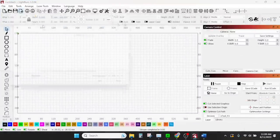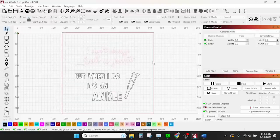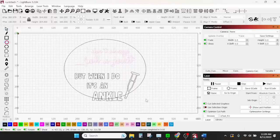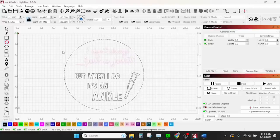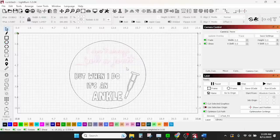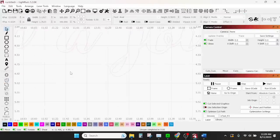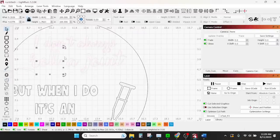Over in Lightburn, we're going to import our image. What I do need is a 10-inch circle, so I'm going to draw a circle while holding shift and make it exactly 10 full inches. Here's where it gets easier in Lightburn: all these are different little cuts and objects, so let's grab them and merge them. That's the one thing you can't do in Creative Space that you can do in Lightburn — we just unite or weld all of these little pieces together.